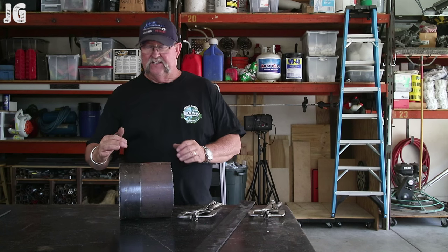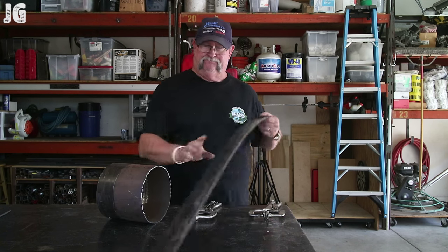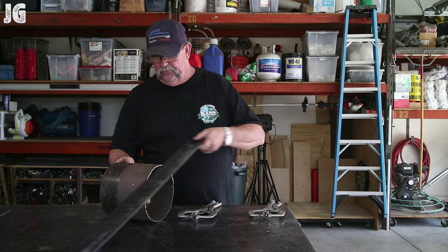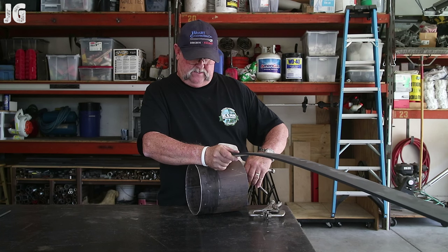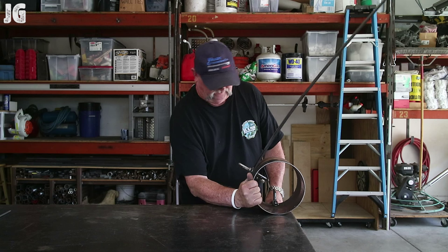Because I need three of these half-pieces — one for each piece of equipment — I'm going to cut two sections and decided to go ahead and cut them at three inches wide. I found this flexible plastic piece and ripped it at two and a half inches, since when I put my plasma torch up against the edge I need about a quarter inch of clearance. It's not quite flexible enough on its own, so I'm going to clamp it to the surface right here.